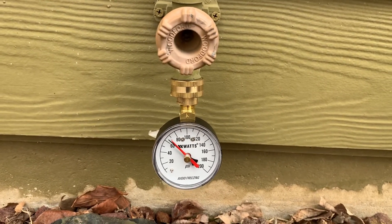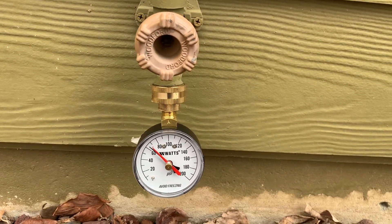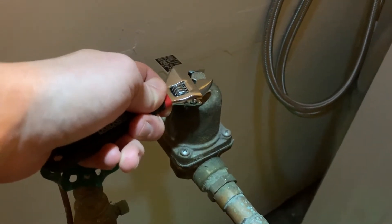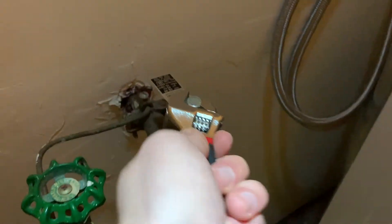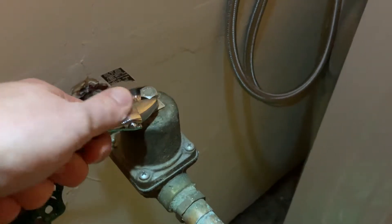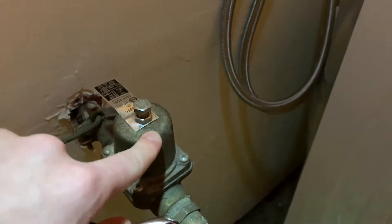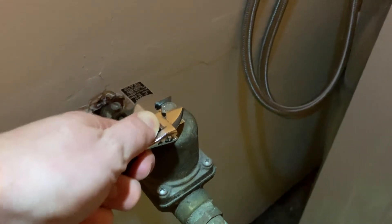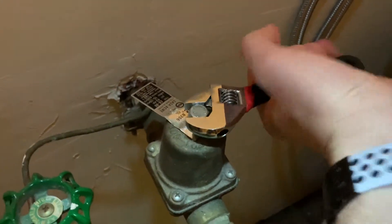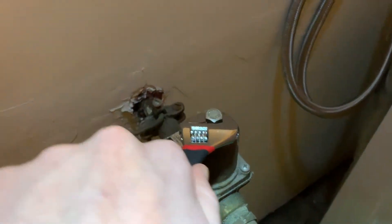I'm not gonna worry about that. Today I just want to get the standard pressure regulated. I'm gonna try to get that down to about 50, which is gonna require a little bit of running back and forth. Back in the basement, we're going to adjust this nut. It seems a little backward to me because you actually extend it and turn it counterclockwise to reduce the pressure, and turn it down to get it closer to increase the pressure. I'm just gonna count how many turns I do — I'm gonna try four turns, then we'll go see what the water pressure is outside. I think 60 is a little high; 50 will probably be just about right.